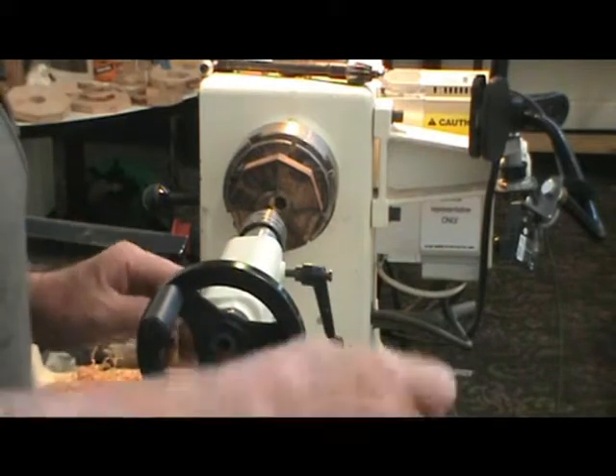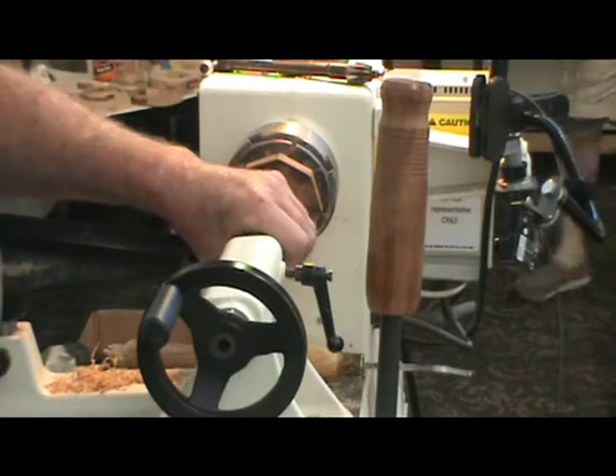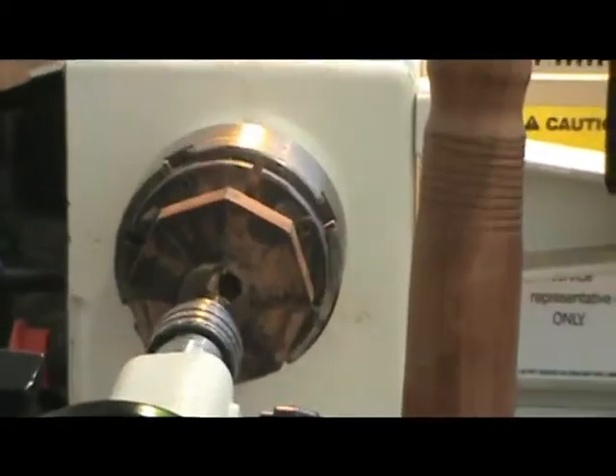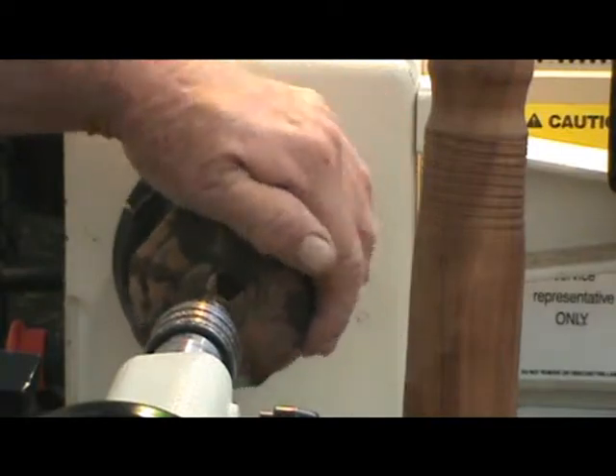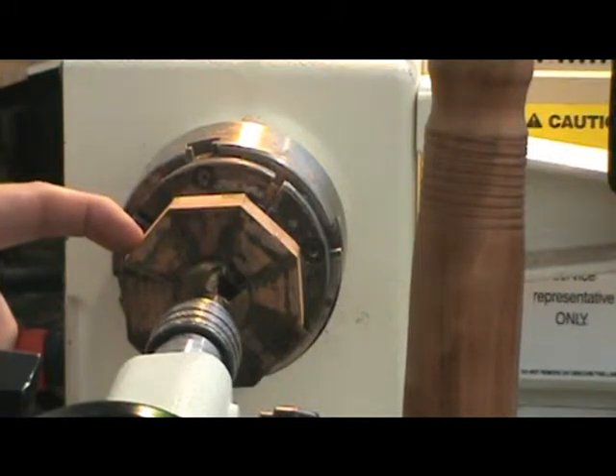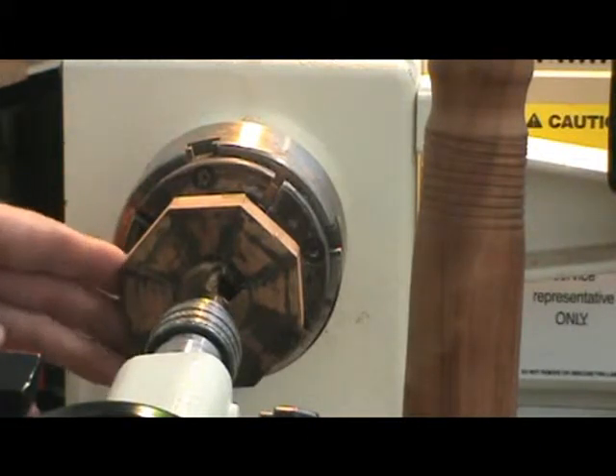The next time I go and take a bowl to Malcolm or Kurt and ask, how am I doing? — the first thing they'll do is turn it over and look at the bottom and say it won't hold together. Kurt Thiebel was very adamant about using a solid piece of wood for the bottom. But I think the solid piece of wood gives you the same problem — if the grain goes this way and the grain goes around, you still have more expansion one way than the other. I think it's just as likely to come apart.